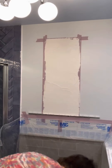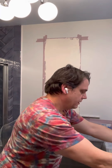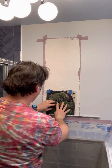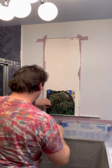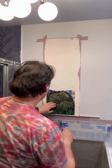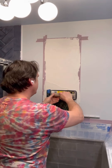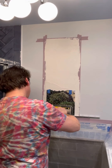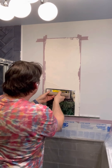I am going to set this mosaic up in place — first piece going up. I've got a regular grout float to press it in, level it out, make it nice without squishing a bunch of mortar up in between the tiles and causing problems with the grout. I want it to be set in there properly.